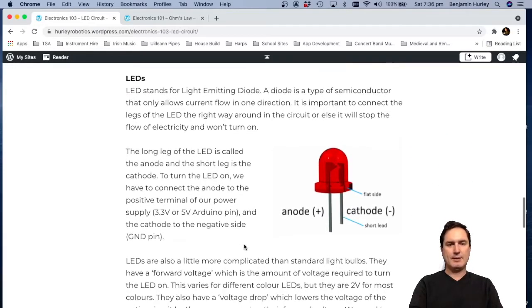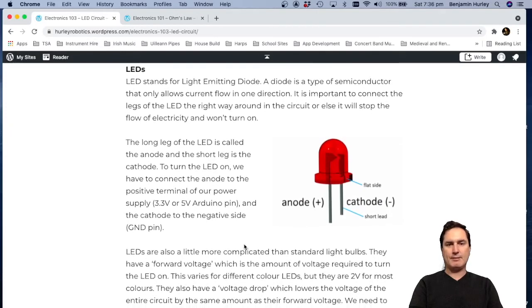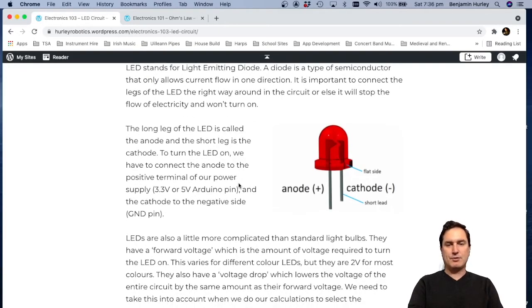Now let's go into a little more detail on LEDs. LED stands for light emitting diode, a type of semiconductor specifically designed to create light. We have to make sure we plug them in the right way around — electricity will only flow one way, it won't blow up, it just won't work. New LEDs have a longer leg (the anode, which connects to the positive side) and a shorter leg (the cathode). There's also a flat edge on the colored case to identify the cathode if the legs have been trimmed.